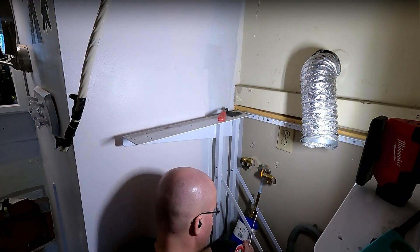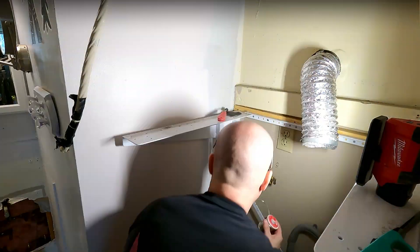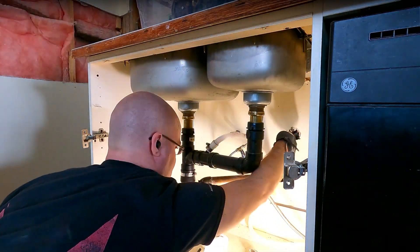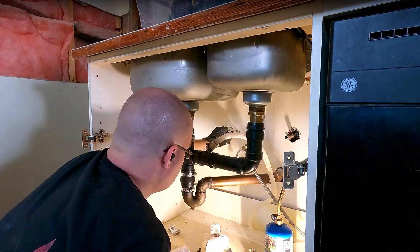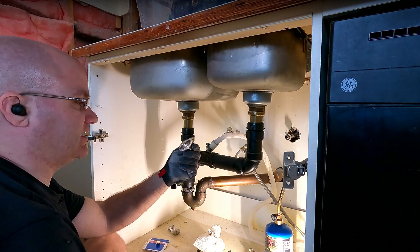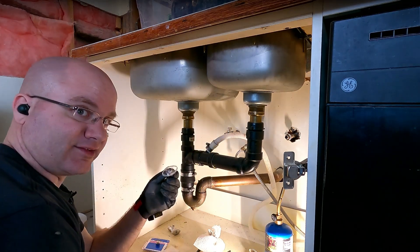The laundry shutoffs got new sweat-on valves — they were the most accessible and easiest to do that on. Plumbing with fire in cramped areas is not my idea of a fun time. I had to re-flow the solder on the kitchen pipes because I didn't have paper towel when I first removed the valves. In the last area, under the kitchen sink — the most cramped — I used compression fittings. I can return the quarter-turn valves I bought and save 20 bucks.